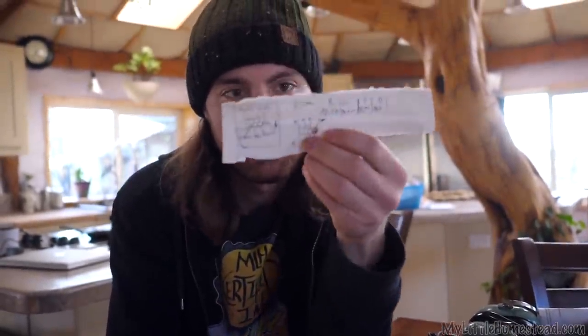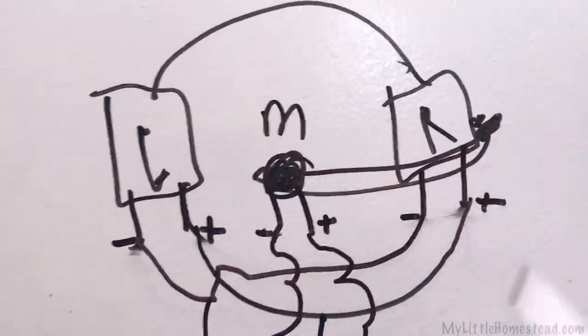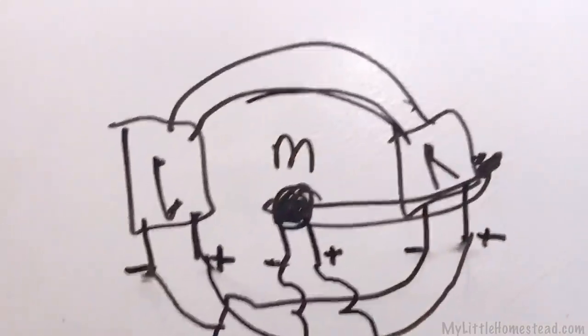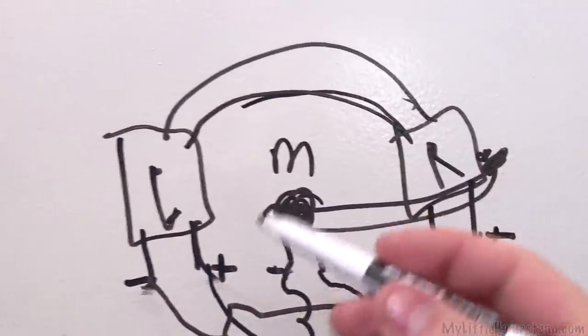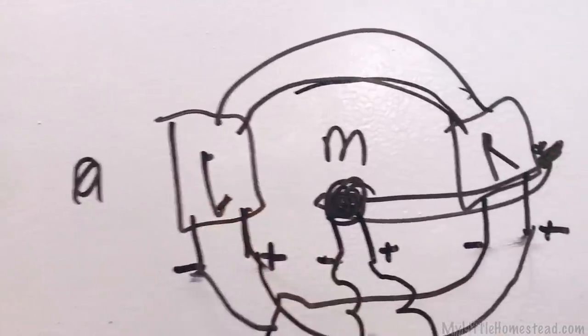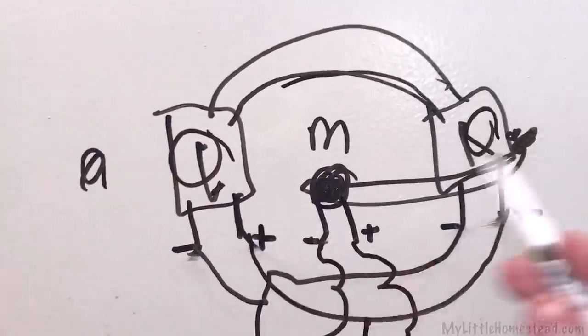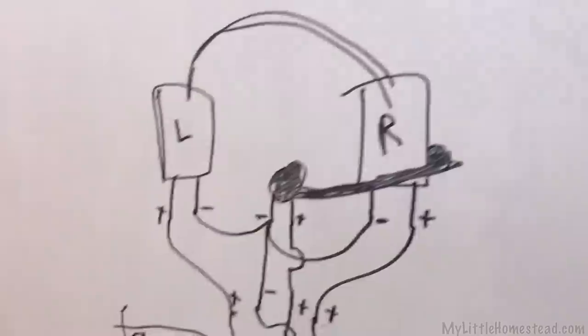I think I've come up with the proper diagram. Here's how the headphones sit right now. The left and right ear are currently wired as mono, as in both as one. The problem with that is if we're playing a video game that's in stereo and sound happens over here, we want to be able to hear it more in the left speaker than the right. So they need to be separate, and in order to do that, I'm going to need to do this.